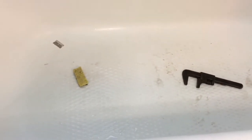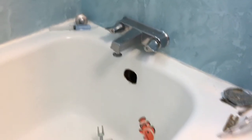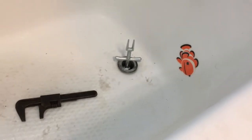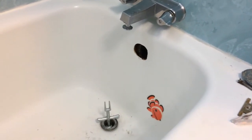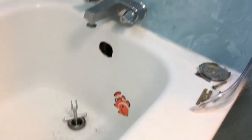I'm on my way to trying to fix this. The problem is we have water — this is like a waterbed in our bathtub. The floor is full of water in between what's an old tub and this skin tub on it. I was trying to find out where the water is coming in, but so far I don't really have any proof. To get the water out, I have this special tool. I'm trying to unscrew the drain now. I'm going to walk the water out towards the drain as best as I can, and then I'm going to silicone the crap out of that hole all around the inner edge.